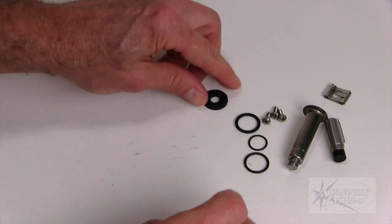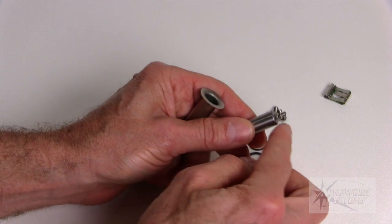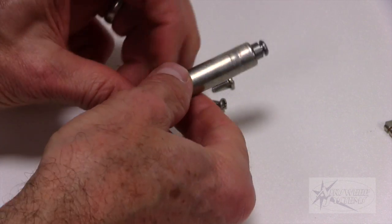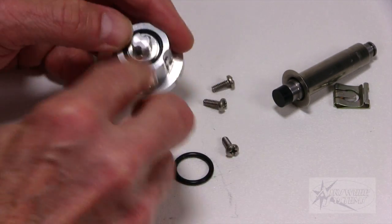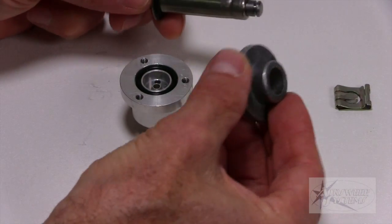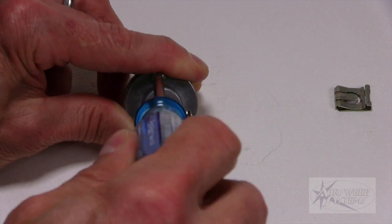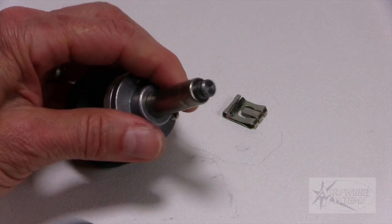Here's the kit with all the replacement parts. The contents include all of the internal parts and some new fasteners: the ferrule assembly and plunger with the spring, the coil retaining clip, the cover screws, three O-rings, and a plastic spacer that we're not going to use with the QR coil. So the first thing we do is insert the plunger spring inside the plunger, making sure the tight-coiled end is protruding out. Then we insert the plunger into the ferrule tube and install the small O-ring on the outside of the ferrule tube, sliding it all the way down to the base. Next we install the other two O-rings onto the pilot assembly, then position the ferrule tube complete with plunger and spring onto the pilot assembly while we slip the retainer cover over the tube, lining it up with the tapped holes. Now we install the screws and tighten evenly. We slip the dust shroud onto the pilot, slip the coil over the ferrule tube, and clip the retainer on top.